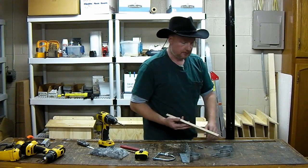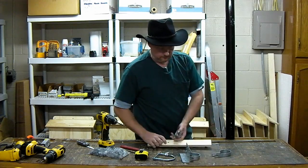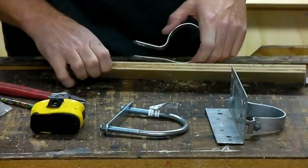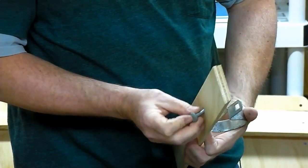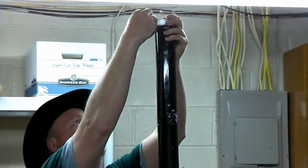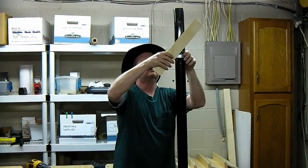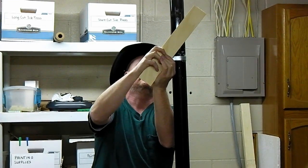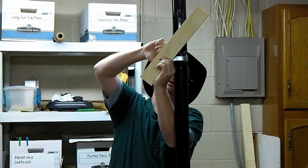Here's how you could use this with these friction band clamps. You put your piece down, center it on the pole, mark and drill a hole a little bit larger than the bolt. You take this — I'll show you about the carriage bolt in a second — get your clamp where you want it, take the bolt. This is why you need to drill the hole just a little bit larger; it makes it easier to get the bolt through. Then put a nut on it.